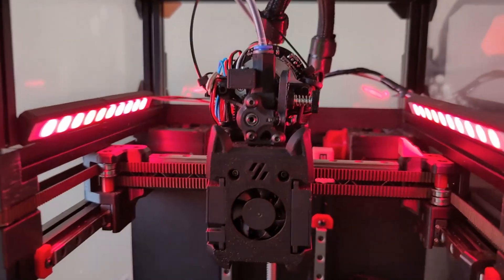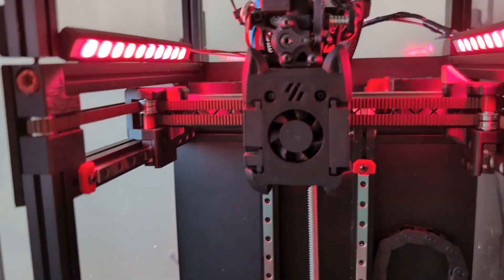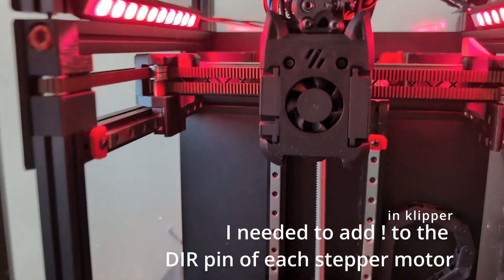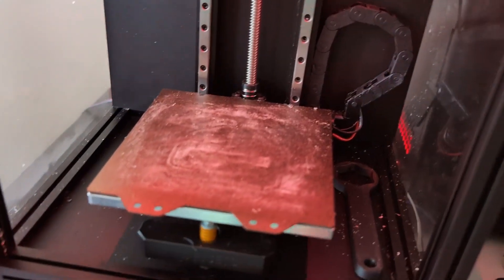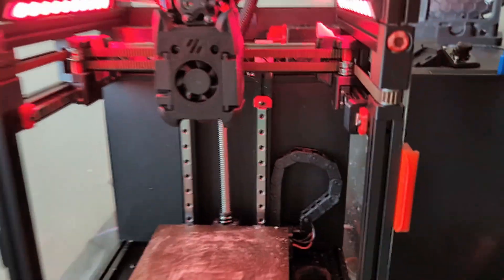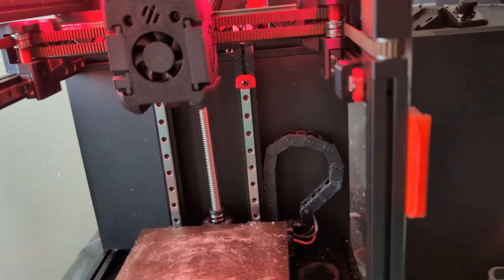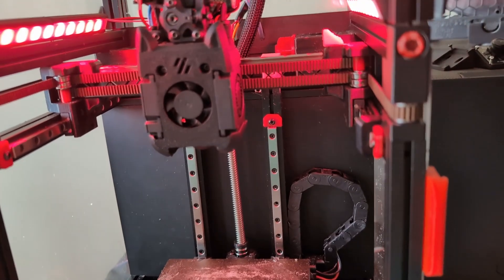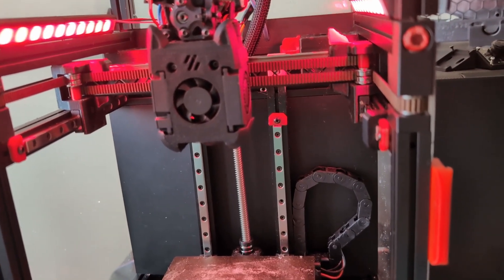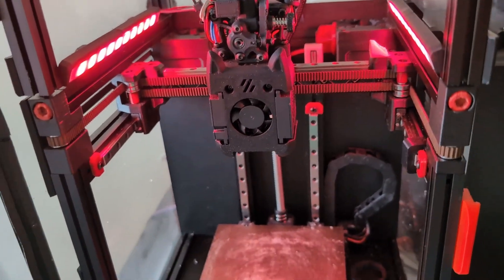There were a bunch of homing issues where it was homing inverted, and my first thought was to swap the connectors for the A and B motors, but it turned out I just needed to invert both motors, so now it's working. I got the end stops set up. I removed the screw here because it lines the nozzle up much better with the edge of the bed - I want the nozzle as close to the edge of the bed as possible. So it should be ready to print. I'll see you in the next clip.